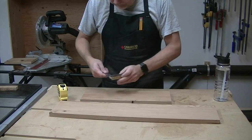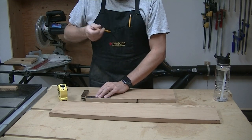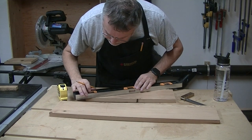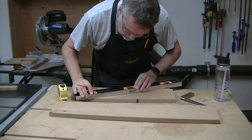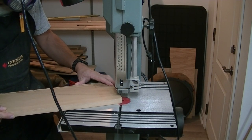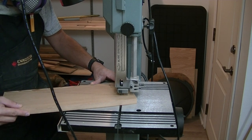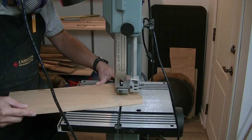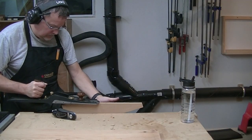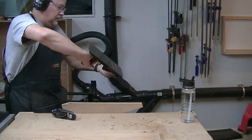Having square sides would have been a bit boring, so I decided to taper the sides slightly. After taking careful measurements, I moved the pieces over to the bandsaw and rough cut the final shape of my sides. This next step could have been done with some sanding, but I prefer to use my planes to smooth out the edges, made for a much nicer job in the end.